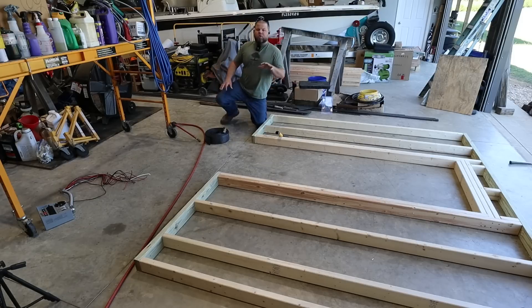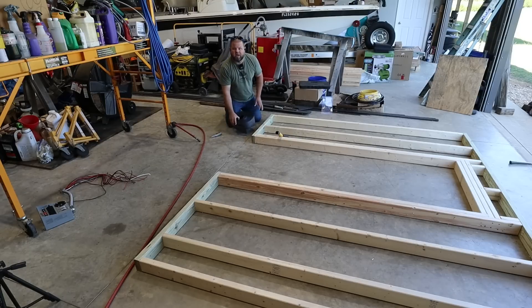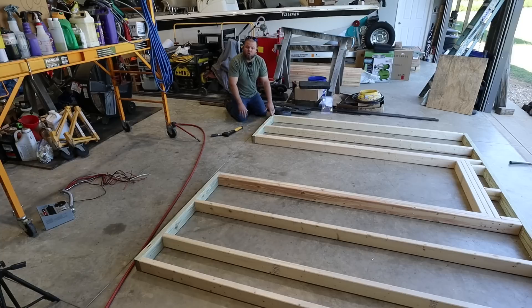The first wall is assembled. You can see I have my rough door opening here. I went and pulled the specs offline. I'm actually having an extremely hard time finding doors anywhere right now — I may have to go to an entirely different state to find a simple interior door. I've framed out the bottom with pressure-treated lumber for my bottom plate because sometimes we do experience a little bit of moisture in here. I'm going to put this foam bottom seal on — it's made just to go on the bottom side. It seals out air, and also provides an additional moisture barrier. I'll pop a couple quick staples in to hold it, and I drilled some holes through the bottom plate where we're going to put concrete anchors to keep the bottom of this wall from ever kicking out.